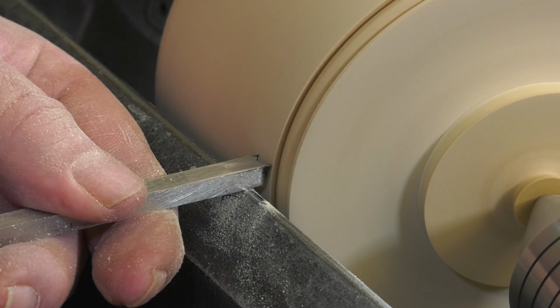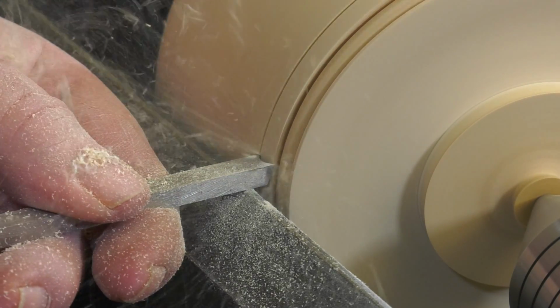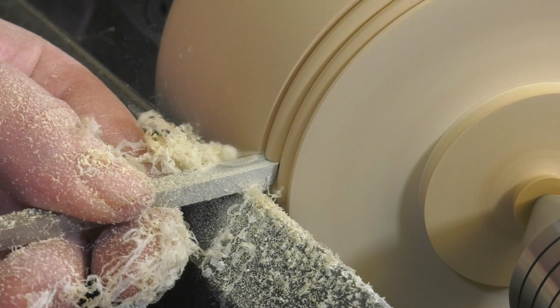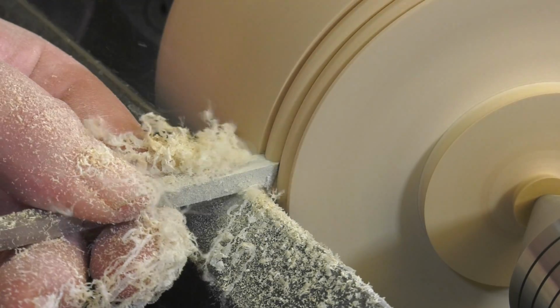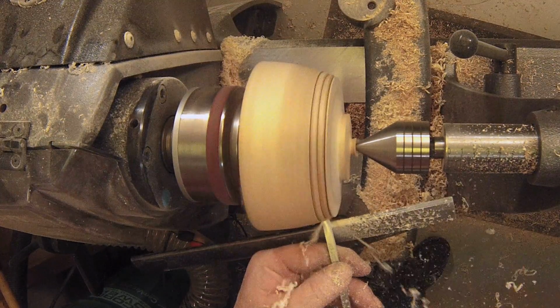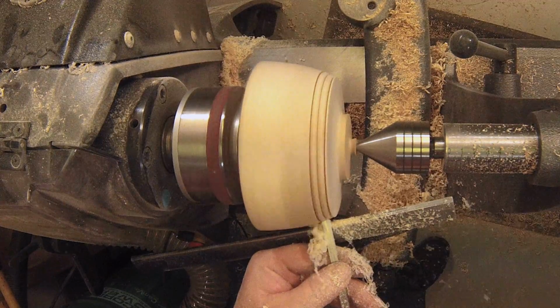Gently touch the surface of the rotating wood and apply a small amount of forward pressure. To assist it, you can sometimes move the handle gently to the left and to the right in a fishtail movement. Continue this action until you are satisfied with the bead you have created.